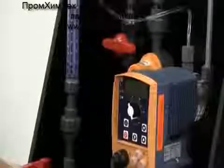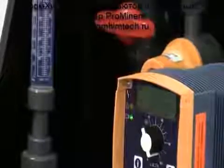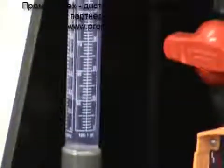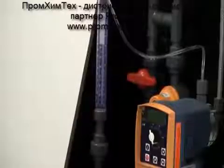I'm going to stop it by pressing the P key — not the start-stop button, but the P key. Then I need to measure how much I drew down and convert that to gallons by dividing our milliliters by 3,785. There are 3,785 milliliters in one gallon. I actually drew down about 100 milliliters, starting about 10 mL above my zero point, which equals 0.0264 gallons.